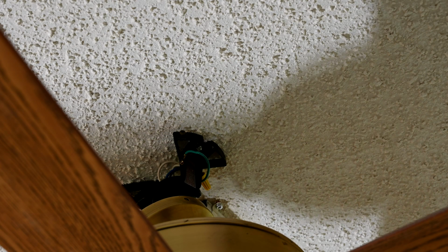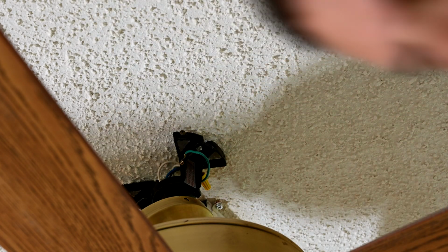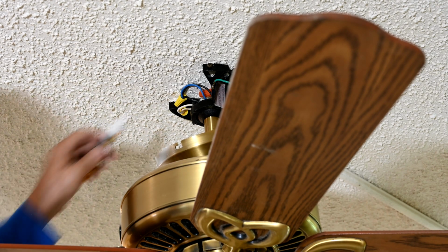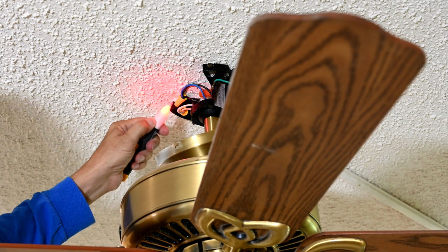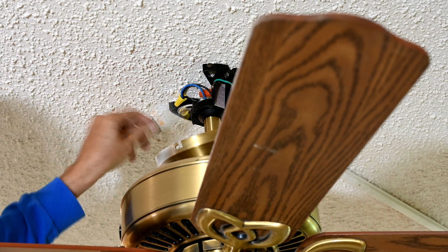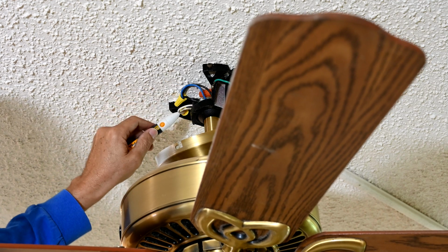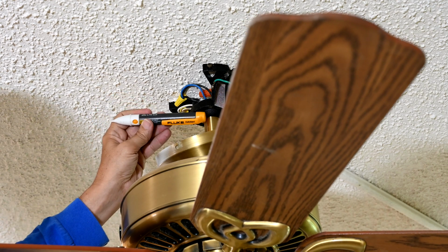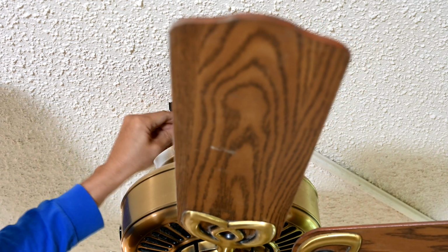Now we're not going to touch anything yet until I get my little tester up there, okay? Don't touch the wiring yet. All right, so we've cut the power now, and I'm going to take my Fluke Volt Alert here and test it again and see, so there's nothing. So now I know I'll be safe touching all of these wires here. I won't get shocked. I can't tell you how many times this thing has saved my life over the years. So I'll put a link down in the description to it so you can see it for yourself.